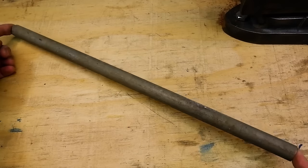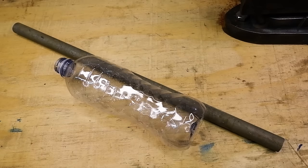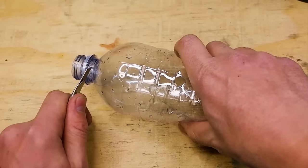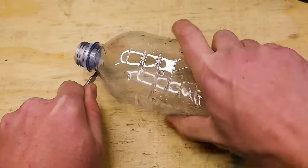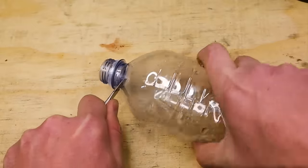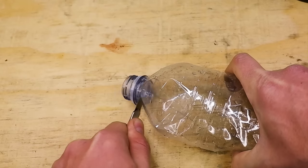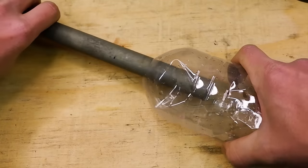The blade still needs to be heat treated and tempered. 1070 is a fairly easy steel to heat treat without specialized equipment like forges and kilns, which is why I chose it for this project. We can use a very simple charcoal and hairdryer setup to achieve good results. Granted, it might not be optimum results, but it will still be a decent knife that can hold an edge.